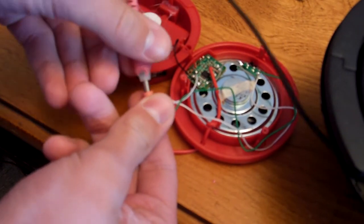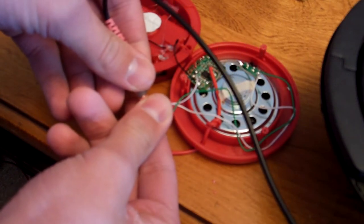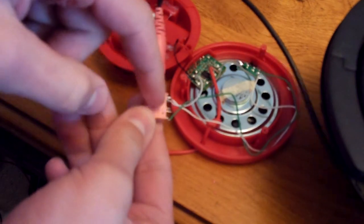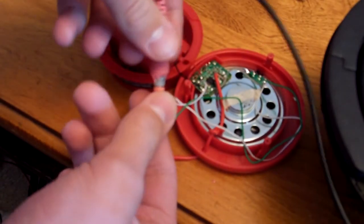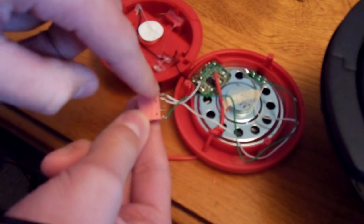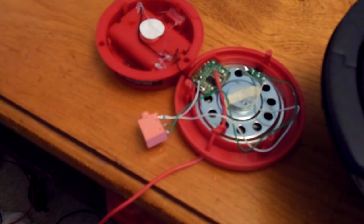As you can see, plugged in, switch is broken inside, so then the audio signal goes through those two pins into there. Unplug it, switch contact goes back together, and goes through the first and the third pins instead. So it's really, really simple.